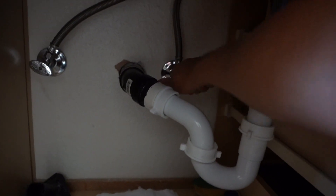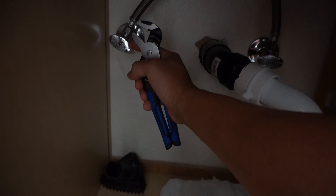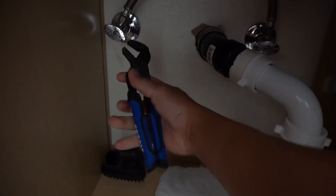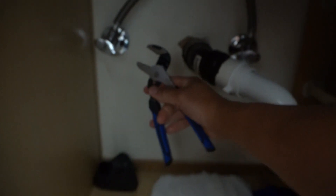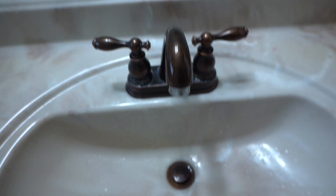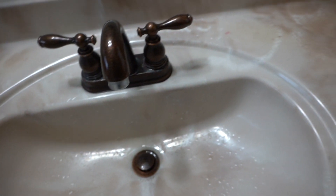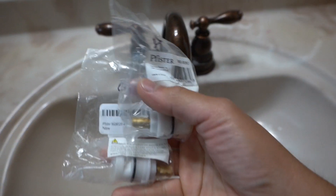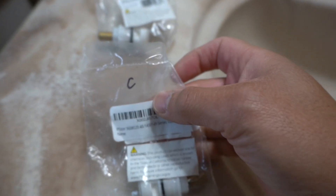In this case, we'll just shut off both water supply lines. Sometimes these knobs right here get really stuck and it's really hard, so if you have channel lock pliers, I highly suggest you use those. Since we're making this video anyway, I want to just replace both cartridges because I already have the two cartridges — I labeled one for the hot and one for the cold.